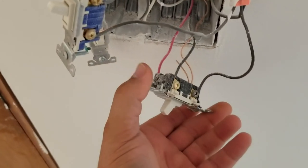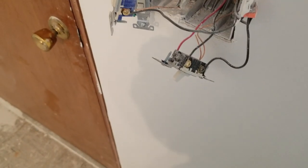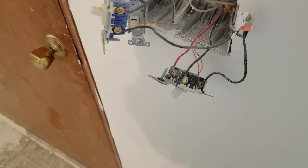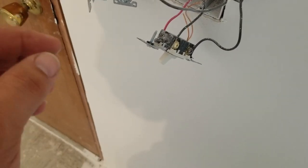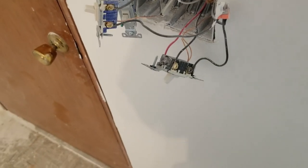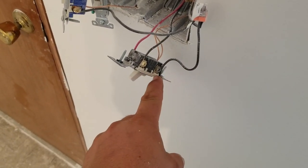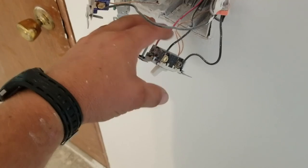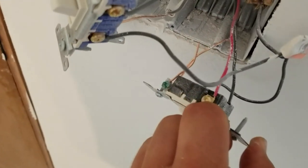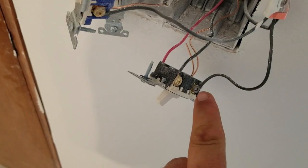When you're doing a three-way, you buy either 12/3 wire or 14/3 wire — it has to have the red, or sometimes black. You pull your hot and it goes to the bottom terminal. Your 14/3 or 12/3 wire goes to your top lugs — your black and your white go to the top lugs on both sides. That's power coming in.